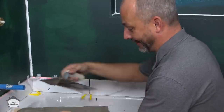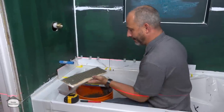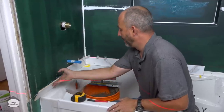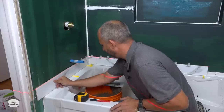Because now I know that I can use half tile all the way up that wall — and I can set my cutter off and say go make 10 tiles cut in half, because I know we're going to need them exactly like that.